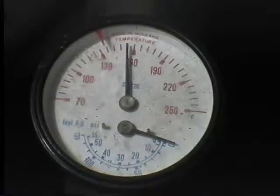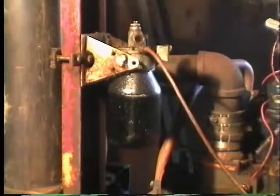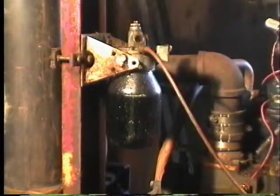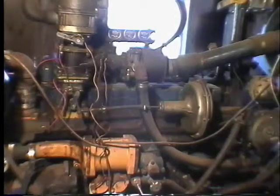We use a wetting agent in the intake manifold — we're using mineral oil in it, about a quarter quart of mineral oil a day. The oil analysis comes back and this thing seems to run fairly clean. We're changing the oil now every five to six weeks, and of course it's in continuous operation, so you're well over a thousand hours. The life of the engines has been running us about two and a half years, and then we're having to put a different motor in and overhaul the old one. The original motor's still in operation — it's been overhauled four or five times.